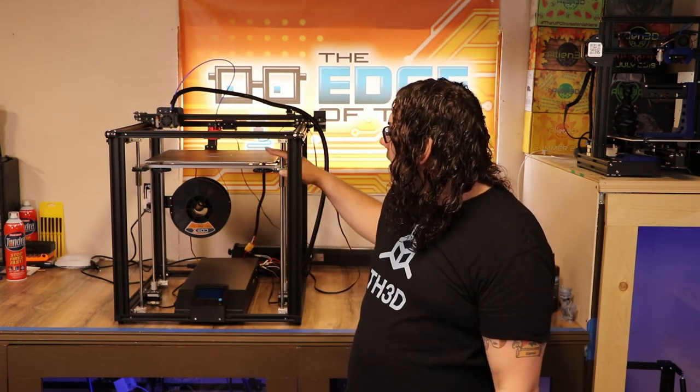I think that just by switching a fan out you get just as good airflow, and you can definitely quiet down the Ender 5 Plus — this thing really needs it. It's a loud printer. Don't forget, you want to make sure your bed is level again just like you would do in the very beginning. Make sure everything is straight because we laid that thing on its side. You never know if it'll shift — you may even want to do a manual bed leveling even though you have the BL Touch on there, just to get it really close. From there, you should be good to go.